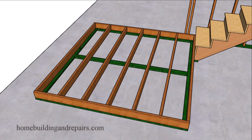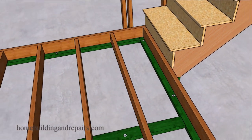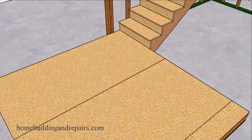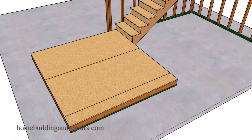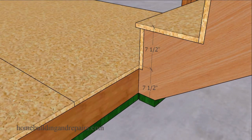For those of you who have noticed, we have cut the ends of the stringer off so that we could butt the joist up against the stringer. As always, if you have any questions about this type of framing, feel free to leave those in the comment area. You can see here where the height is exactly the same for our newly remodeled platform, and something like this will definitely make the building inspector happy.